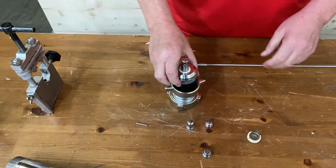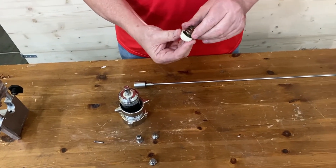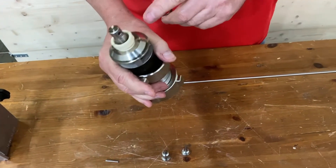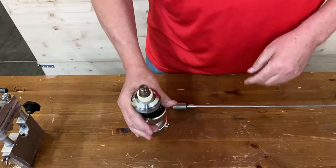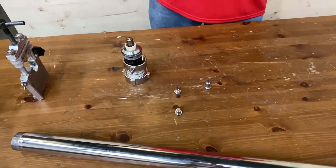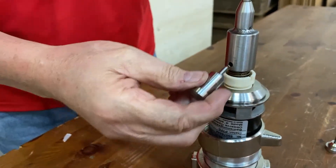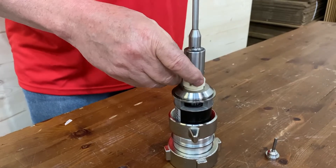Put it back here. With your mechanical seal, this is your other part. Make sure this spring is in the little slot that makes it turn. You slide it back on gently. Once you have that done, if you notice, there are your holes for your pin to go through. So once you get everything back together, make sure you keep this piece handy and find your holes. Line up your holes and get this piece and put it in so it'll snap in there — it'll keep your shaft from getting out of sync.